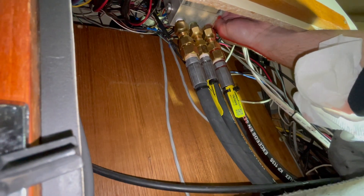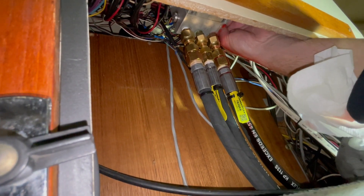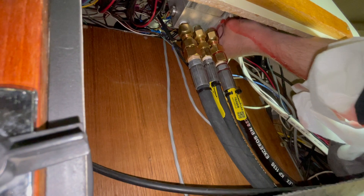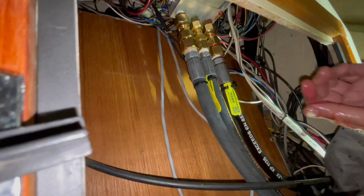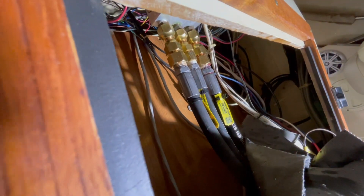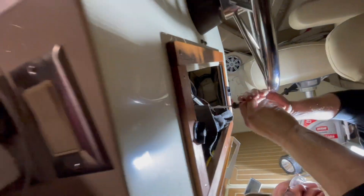Were you just using the spring? Just wiggling the plug a little bit to let air escape, but I think we're done. So inside that plug there's a spring — he had the plug out and was just using hand pressure on the plug itself to slowly purge the air. And I think we're done. Done with that side. We'll check it again. So we got the starboard side bled and a little bit of a mess, but no big deal. Then we'll just do the same thing to the port side — I'm not going to video that because of the way we're situated here.